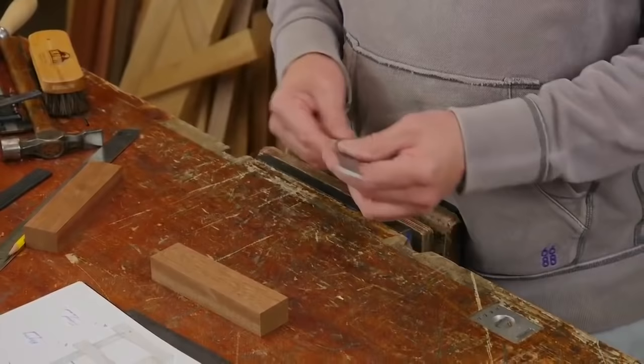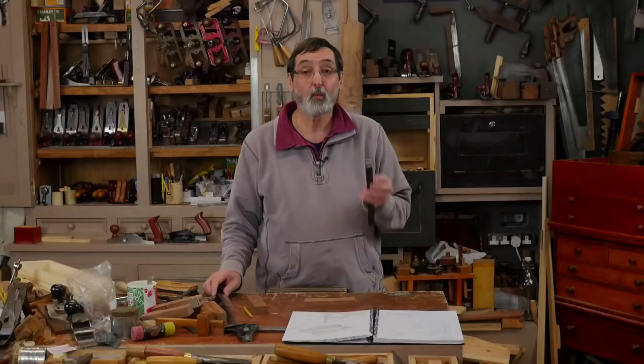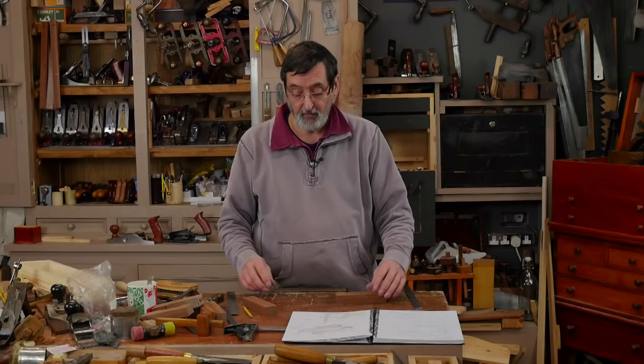This is the exact size. It's 3/4 of an inch dead on. The steel size probably will be exact, but work to the steel, not to a measurement. I may say 3/4 of an inch, but you have to work to the size of the steel stock you've got. So we're going to make a hole through here,